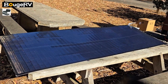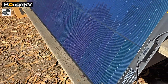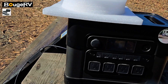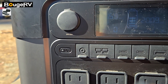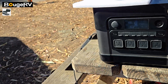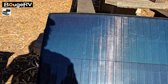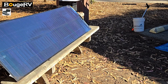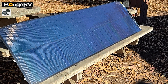With the self-adhesive attached — I think it was 110 watts when the panel was flat on the table. Now I have it angled properly at the sun in a good direction and it is getting 160 watts! That's about a 60-watt difference. It's not directly at the sun — it's at an angle and the sun is a little to the left — but that's almost 60 extra watts. Goes to show you how important the positioning of these panels is.